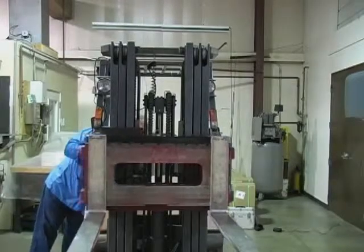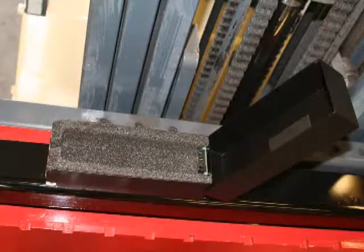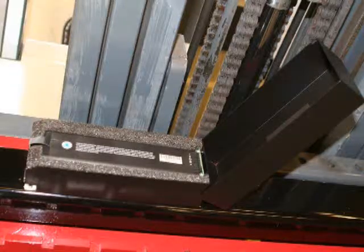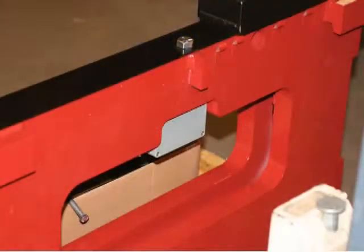If using a wireless version of the CLS scale, the iCube junction box power is supplied by a lithium-ion battery. The battery is located on top of the reinforced cover plate in a painted, hinged enclosure. A coiled cable is not included with the wireless version. The junction box is factory wired and located between the front and back carriage plates of the scale, providing protection for the junction box from debris or damage.